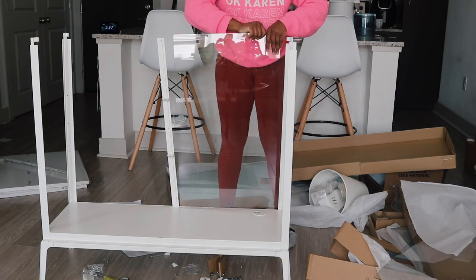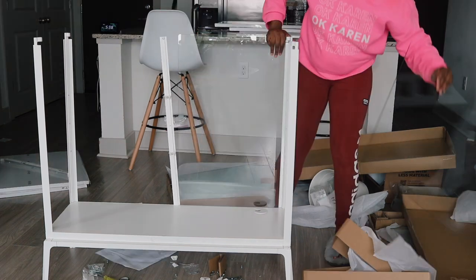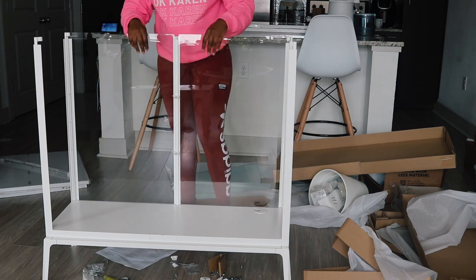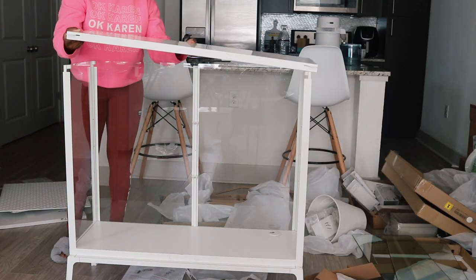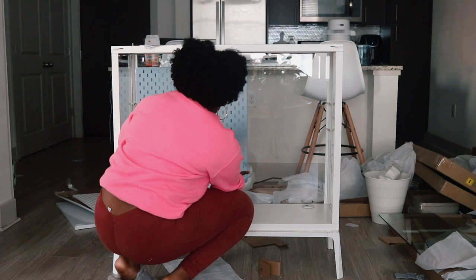After the holes are drilled, add a desk grommet to cover the holes and keep the cord in place — also linked in my Amazon shop in the description box below. Now carefully add the glass to all three sides. They all snap into place easily, but make sure that you are aligning them properly with the base so that they don't fall out before you tighten them. Then add the top that will screw into the doors later. It's easier to add the pegboard — or whatever you'll be using to hold up your plant shelves — before you add the glass doors.